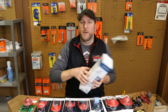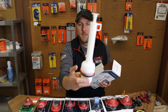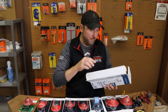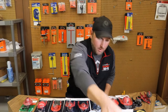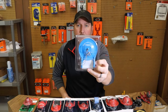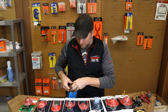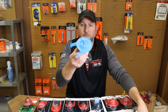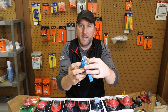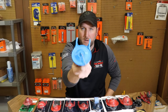And Mansfield makes a piston style flush valve — the Mansfield 210 and 211 flush valves — that also has a gasket on the bottom. They've actually done this style for a very long time. Last but not least, this one here is probably one of the most popular flappers I sell these days — a blue soft three inch flapper that fits a lot of your AquaSource and Glacier Bay toilets. This will fade a little bit after time and then kind of curl up and start leaking on you, but I sell quite a bit of these.